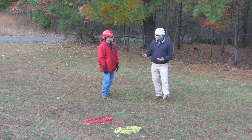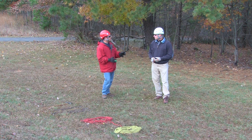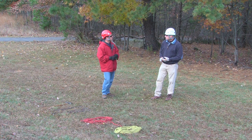If you get into extremely heavy loads, we'll set up like 3-2-1s or multiple 3-2-1s joined together. But we're just going to do a basic 1-1-1 picket system which normally meets our requirements. A 1-picket system is normally rated for about 700 pounds, a 1-1 being around 1,400 pounds, and a 1-1-1 is normally gauged at around 2,000 pounds.